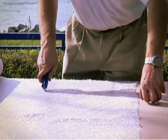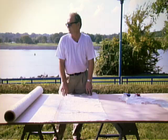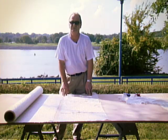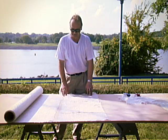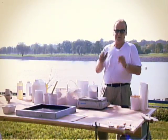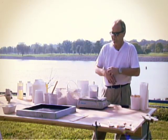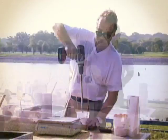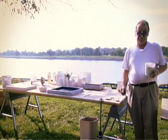Having cut your fabric to size, we now need to prepare the material to make the laminates. As a general rule of thumb, roughly three times the amount used for the gel coat will produce your laminated structure at around a quarter of an inch thick, which is plenty thick enough because of the stiffness and yield given by the structured fabric. Having weighed out the two components, we need to pigment it to the same colour as the gel coat. Not only does this make the product look as if it was meant to be, if there are any pinholes in the gel coat, you won't see them when you put the backing on. You obviously don't need any thickener for the backing mix.